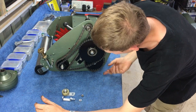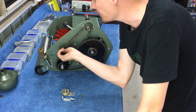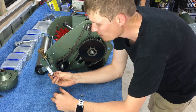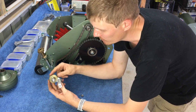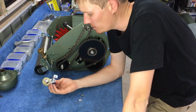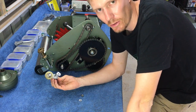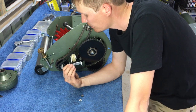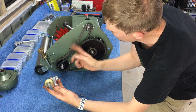I've got all the chains up there - they're all very loose still, I've done that on purpose. Next we need to install our chain tensioner, which is going to go through this bolt hole here. Being a solid, we need to install our chain cover bracket at the same time. That's quite simple - it goes through the bracket for the chain tensioner. I do plan on replacing this with an upgraded version that George at SB Fabrication and Parts offers, but for the sake of this video we're going to reuse the original one, which is in very good condition and probably has a good lifespan left.